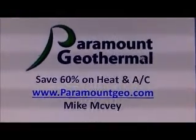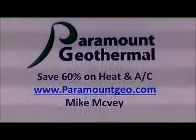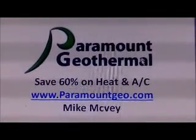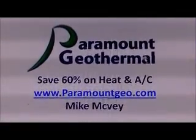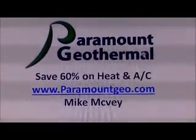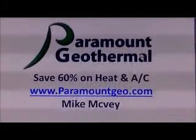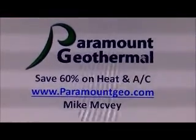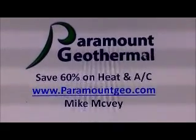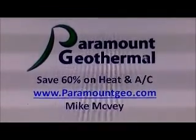I made some measurements on this system before and after, and what I noted was, before the system was operating using the existing outdoor heat pumps and the air handlers in the attic and closet, that the efficiency improved once we added the new pump and inject well system, primarily because the water coming out of the ground is at 75 degrees, as verified on these temperature pressure gauges that I showed you, and that's increasing the efficiency of the heat pump. So this heat pump is now operating about 10% more efficiently. And in fact, I checked the air temperature coming out of the supply vents, and it's about 5 to 7 degrees cooler than it was prior to the installation.